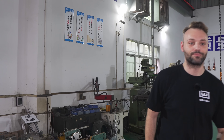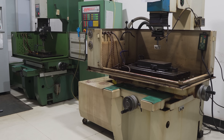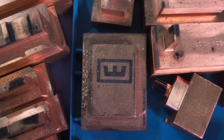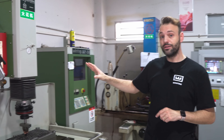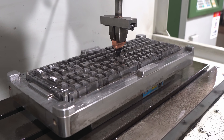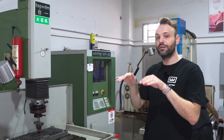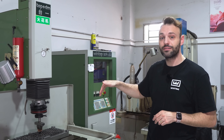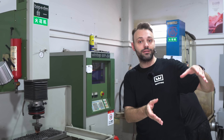Here we are at the mold making area. These are all called EDM machines — it's basically a machine that uses electric sparking to melt through metal, and to get that sparking happening it needs copper plates because copper conducts electricity really well. The machine has a jig holding a copper part with a black piece sticking out — that's where it conducts electricity and creates sparks. It's sometimes called a sparking machine, and it slowly melts through the metal until it reaches the position needed to create all the cavities required for that specific mold.